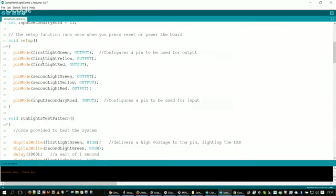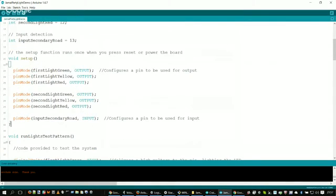And then we'll talk just for a few seconds here about how the Arduino works. So there's a function here that's called setup. This is what the Arduino microcontroller itself and the bootstrap language that is put inside there reads in your code. It says whatever the person writing the code puts into the setup function, I'm going to process that one time when you power up the board. So that's where you put all of the functions where you want to say, okay, this is how I'm going to set things up. Everything in setup only gets run one time.